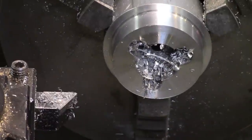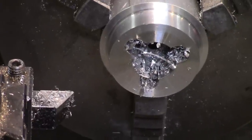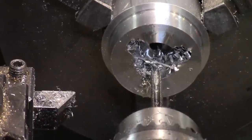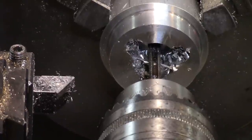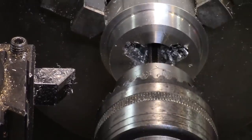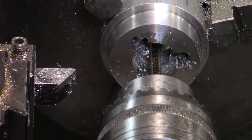All right, holes drilled. All we need is a tap. I'll find one. Now, of course, we've got other things that we have to do before we're finished, but this will make a good start on it. Make sure this is nice and loose to slide around here. Clean a little of the chips off in front of it. It's going to be plenty good enough for thread, I think, like it is, but I'll give it one more shot in.